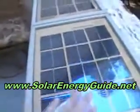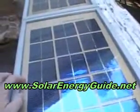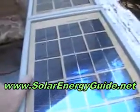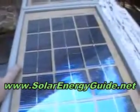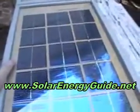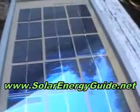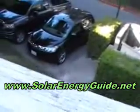This is a solar panel that is made up of 3 parts. It has the frame on the outer side, it has a glass top, and then it has the solar panel below. This white material that I'm pointing at right here, this backing material, is simply a compressed paper product. You can buy it at any hardware store. It's a 1/4 inch thick. And then below that I have another one that's a 1/4 inch thick, and I have the wood routed for the glass. So the glass goes inside right here, and then I'm going to caulk this section here.